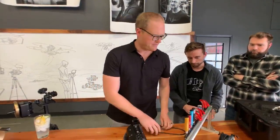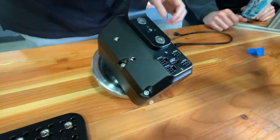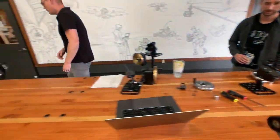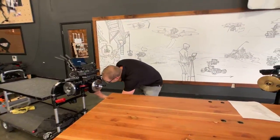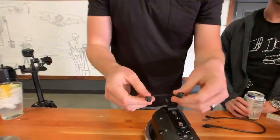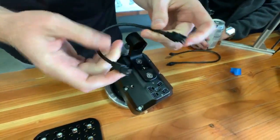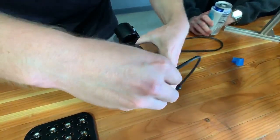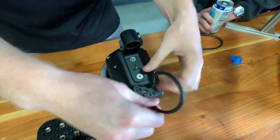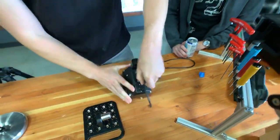Then we have the cabling. There are CAN connectors and UART connectors. These are standard little FreeFly cables — if you've worked with Movi Pro, they're overmolded micro-fit latching connectors. Those just plug in and allow you to daisy chain the CAN connections on the wheel modules and whatever else you want to daisy chain. There's an input and an output for CAN. You plug it in, daisy chain module to module to module, and there you go.